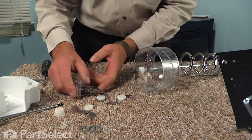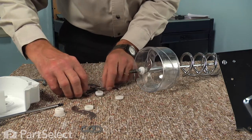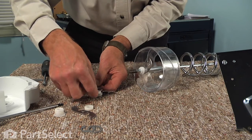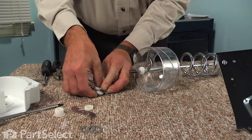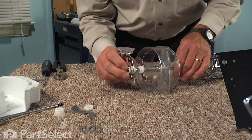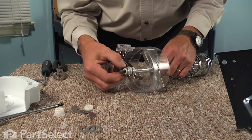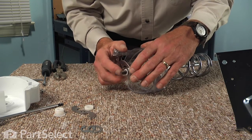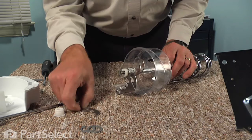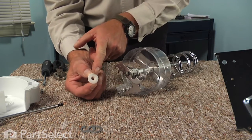Then we're going to assemble the fixed blades with the rotating blade in the middle. You may be able to put this together in one piece with a flat bushing in the middle and then just press it together. Slide it over the shaft and you'll need to rotate it until it lines up with that middle blade — then it should look like this. Again, we have a double bushing facing the end of the shaft. Next, we'll put the straight bushing in place, then our final blade.